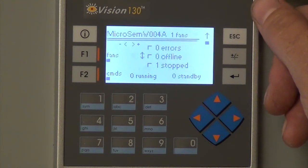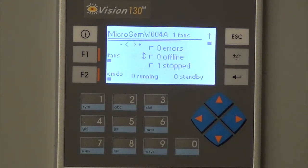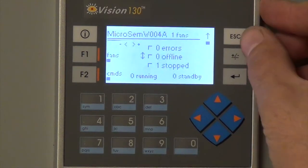There's four breakers. So there should be three fan filter units on a single breaker. So there's two breakers for the six in the back. There's one breaker for this one, and then there's, I believe, one for this and the next one. Okay. Yeah, so there's the label for the power, and this is obviously the FFU1. So it correlates with everything that's on the display screen. Yep.